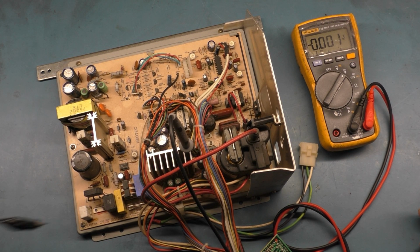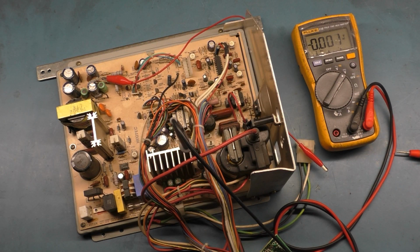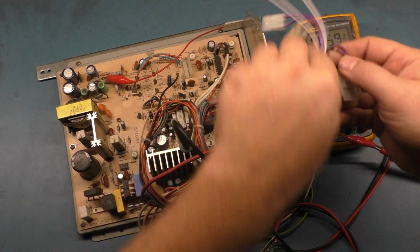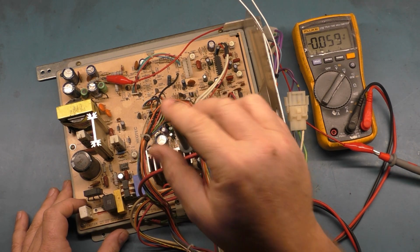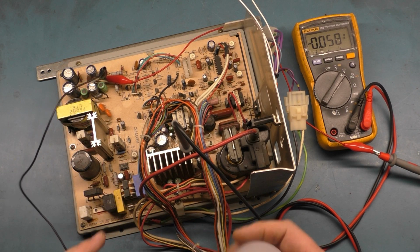Let's grab a couple of alligator clips. And we'll clip onto our positive, and we'll clip this on here. And we don't need one for negative, so let's, all right, I don't know why I always grab two, out of habit, I guess. Let's plug in our voltage power. Okay, we got 117 out. We're hooked up to read our B+ DC voltage. We're plugged in. We got a ground connected. Let's grab our light bulb. And we'll hook up another lead here. Okay, let's turn it on.